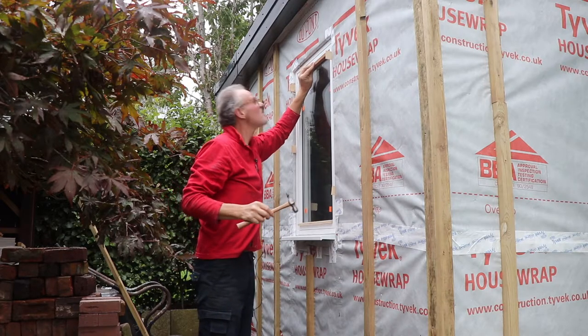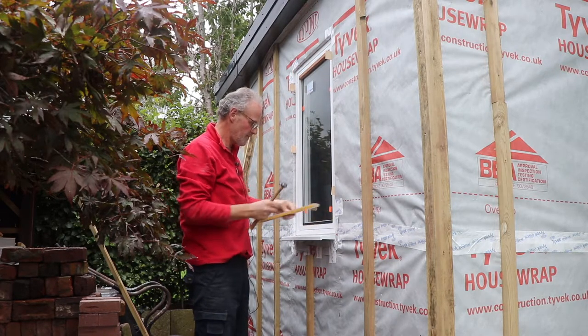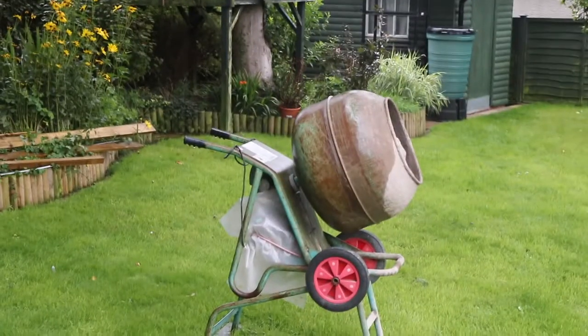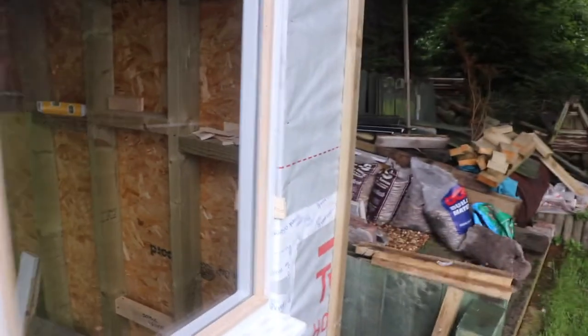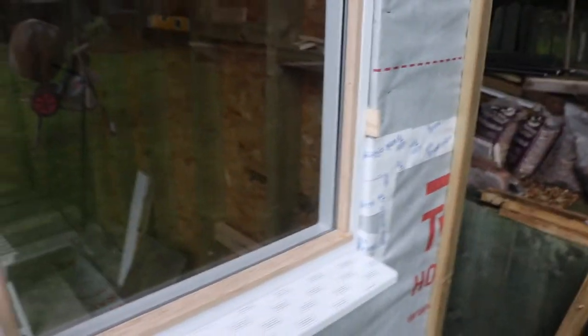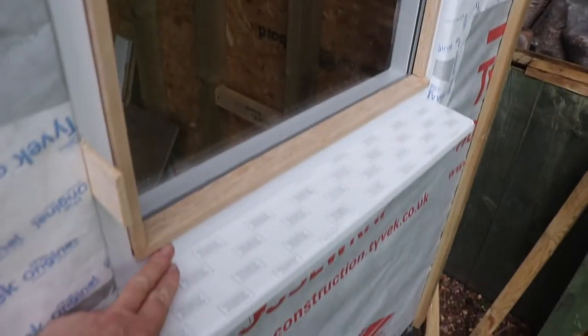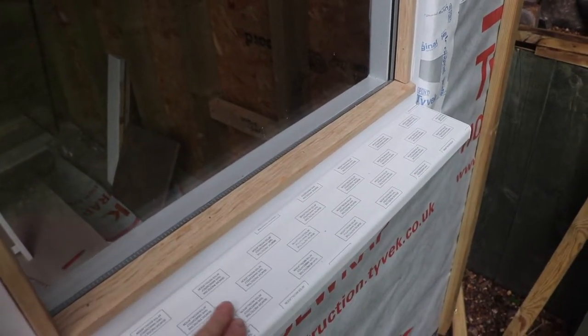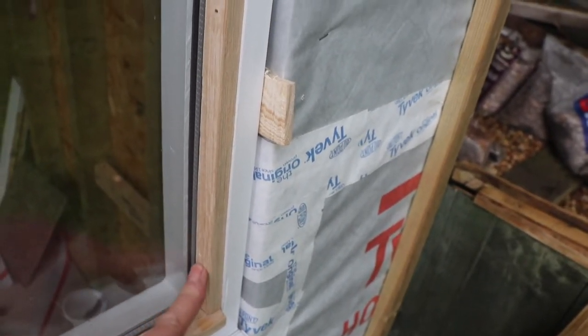One more pin. It's been threatening to rain all day and it's arrived, so I'm trying to put these windows in but it's a bit of a struggle with the rain. However, I'm making some progress. I've got the glass in and I've got the beading. The beading at the bottom will overhang a little bit so that any water that comes down off the window will drain clear onto the window sill. I've used stainless steel panel pins at about four positions up and down.